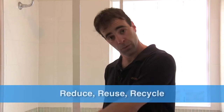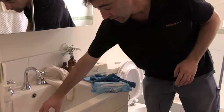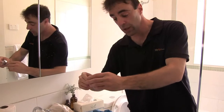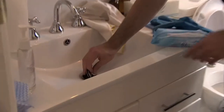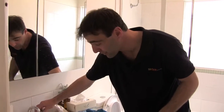In the bathroom we've got toilet, shower, vanity and that type of thing. On the maintenance side, something a lot of people don't know is that tap washers do wear out over time and can be replaced. This one has just been replaced — it's just a matter of unscrewing the old one and putting the new one on. If the washer is worn out, it won't hold the water anymore, which causes dripping taps. Changing the washers every now and then does help, and we'll get a plumber to demonstrate that later in the show.